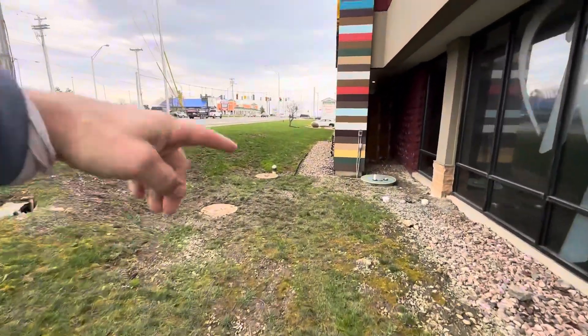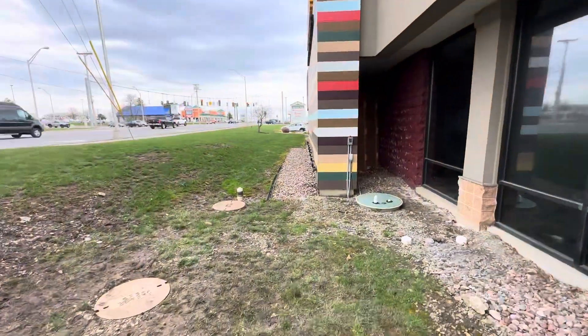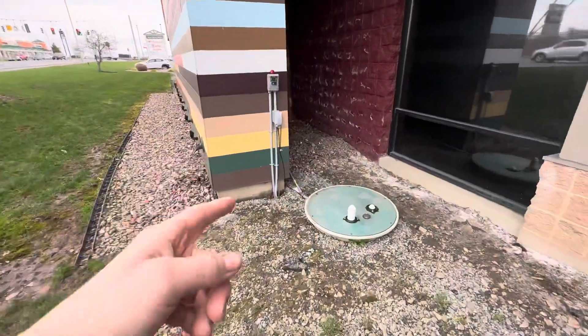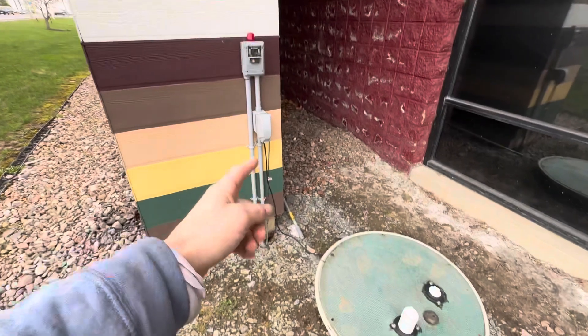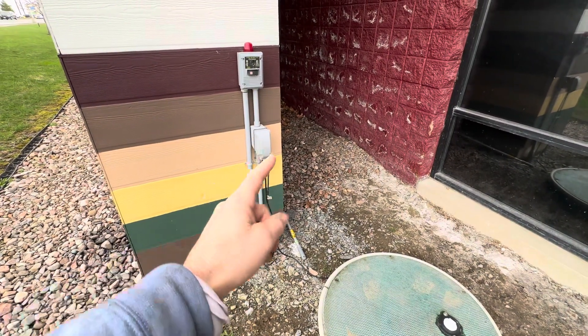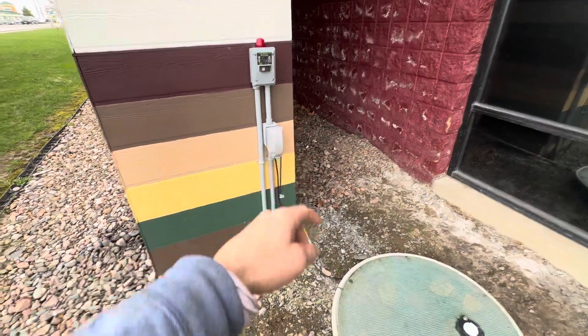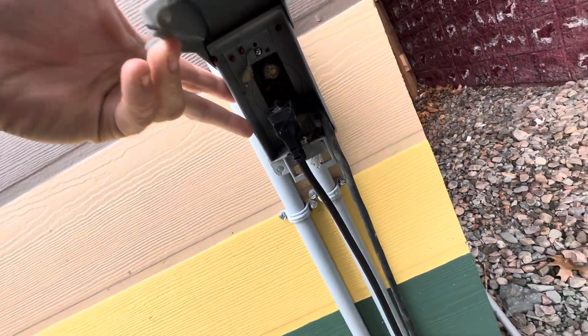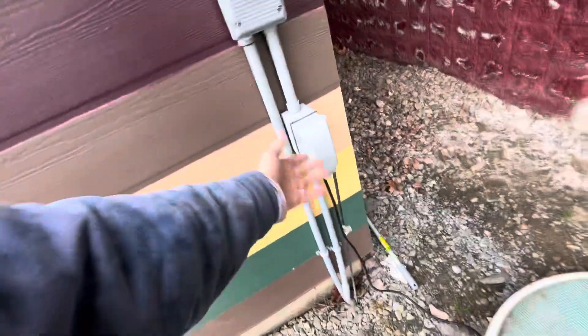As an alternative to one large pump station, tech is noting that a 2-inch conduit with a weather head could be added so that the pump wire can hang out and go into this GFCI box. You should get a heavy-duty in-use box cover as well, so plugs and wires aren't hanging out like that.